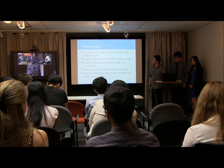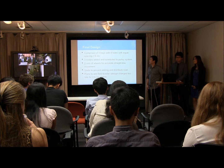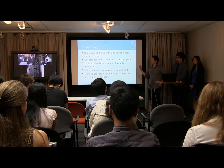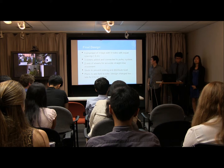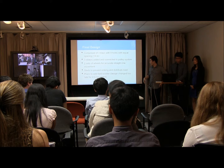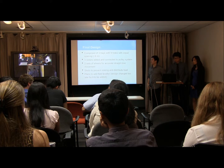For the US site final design — you may have seen the big device in the poster presentation — we have the same concept: three trays with a sliding plate connected to the pulley mechanism and two wheels. As mentioned, there is a small cut that helps the device go straight. This is a lot better than the previous pontoon design because now we have sleds plus wheels, so it doesn't sink anymore. We also planned to attach a field leveler, but had some time issues and couldn't finish that.